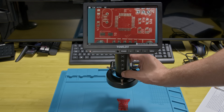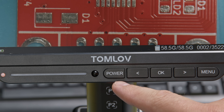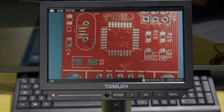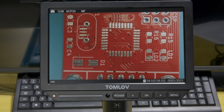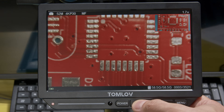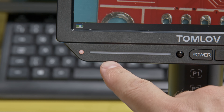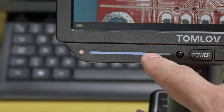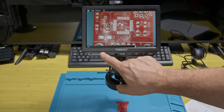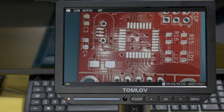On my old microscope I had to use the knobs to move the scope up and down. Below the screen we have the power button — the remote can't power the unit on, only off, so this button is important. There's an OK button which can enter and switch modes; on the main screen it takes a still image. The right and left buttons are for digitally zooming in and out, and I'm actually surprised at just how good the digital zoom is — it transitions smoothly and it's not digitally noisy. The scope's internal LED lights are controlled using a capacitive strip. This is great for matte subjects but unfortunately working on circuit boards it can create quite a lot of glare, which is actually quite good for finding solder bridges, but not much else.